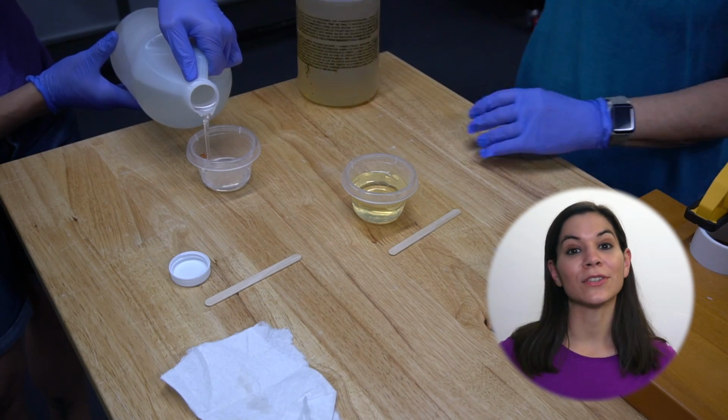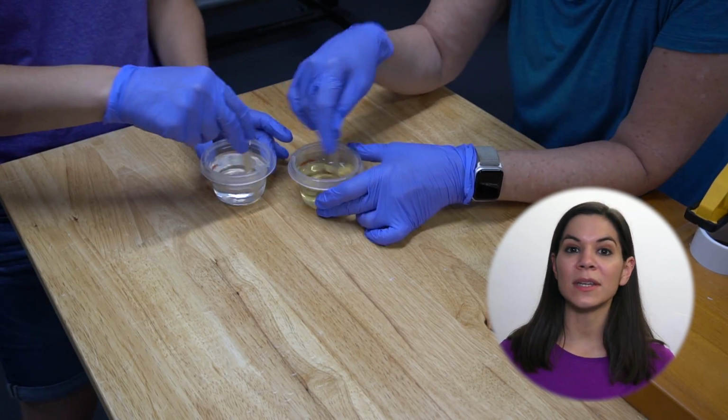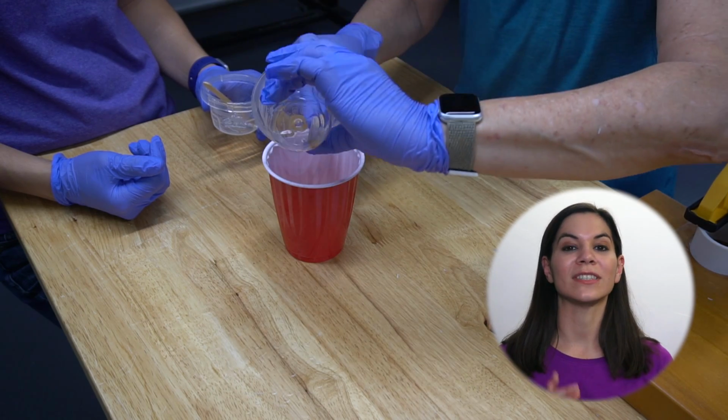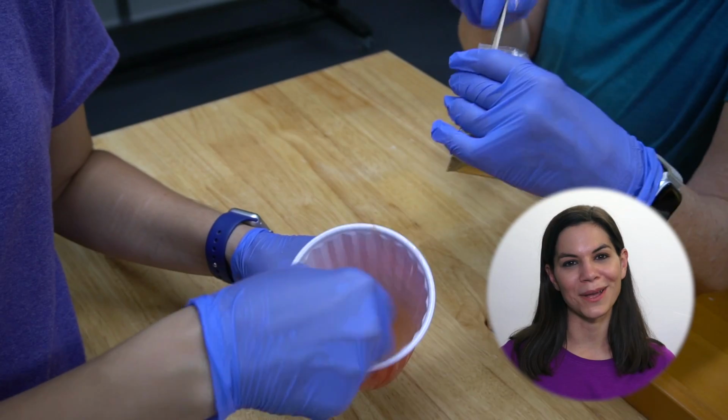In our original video, you suggested using epoxy to fill in some of the PVC pipe, so that's what we're doing here. We're using epoxy that's a 1-to-1 hardener to resin. And if I have any advice for you on epoxy, it is follow the instructions exactly, because they're all a little different and it will tell you exactly what you need to do to make sure you have a good outcome.